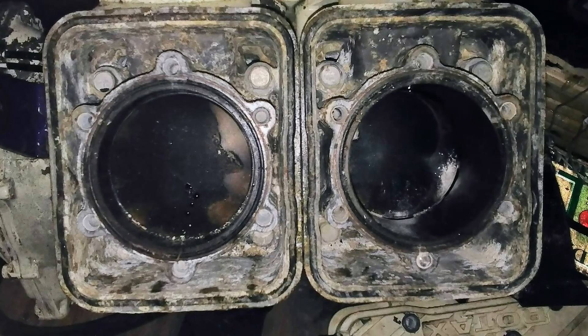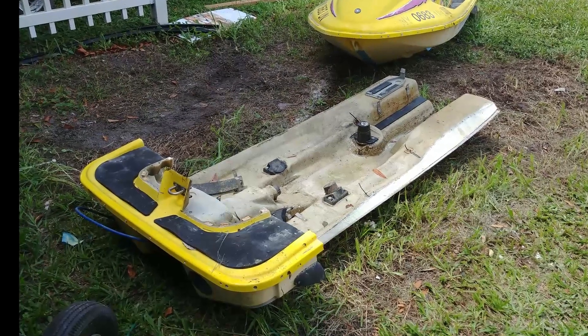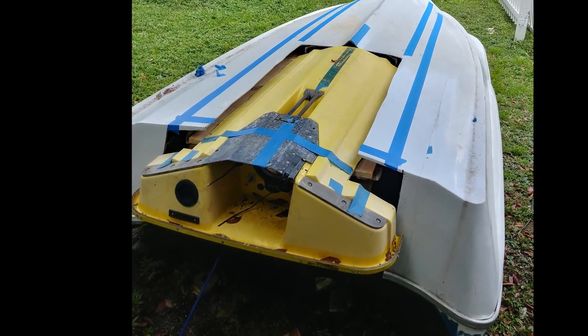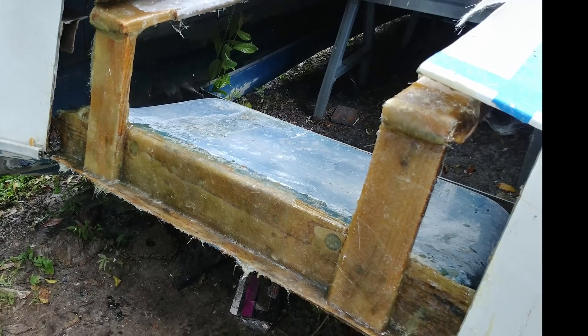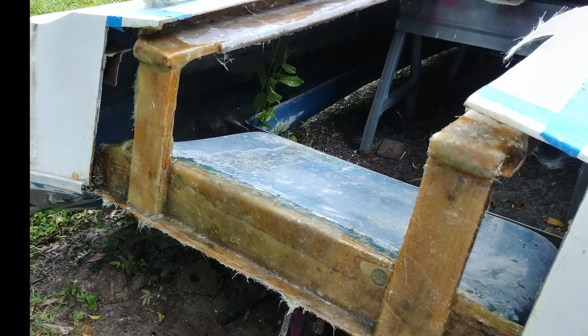I got the engine out — it was filthy and has yet to be rebuilt — then cut up the ski hull, marked where in the boat the ski hole was going to go, and cut that. I may have cut it a little prematurely, so I ended up with an oversized hole. I decided to build a wooden framework to hold up the jet ski portion and bond that fiberglass all into the existing framework of the boat. It ended up super strong and feels pretty good.